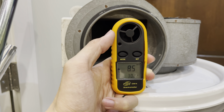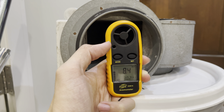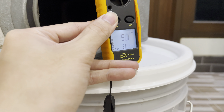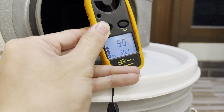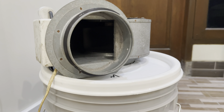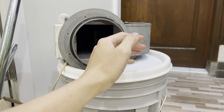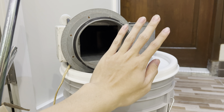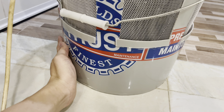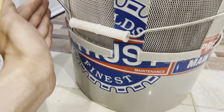The air coming out is at most 29.5°C. After leaving the thermometer for about five minutes, the room air temperature was about 30.6°C and the air outlet coming out reads 30.1°C — not much of a drop. That said, the difference is noticeable, and down near the reservoir where the water is, it is most noticeably cooler than it is up near the cooling pad or the blower.